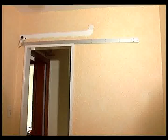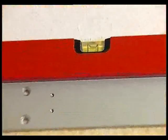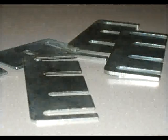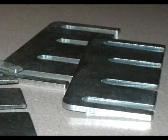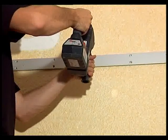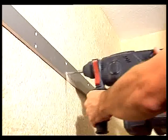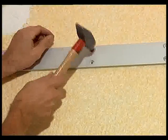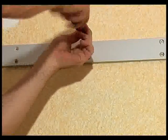At this point, it is essential that you abide exactly by the stipulated dimensions, so double-check and readjust if required. Use the enclosed distance plate to compensate uneven walls and discrepancies regarding the clearance with respect to the door frame. The shim plate is also used as drilling template and need not be removed as long as you stick to all dimensions. The next step is to drill all further fixing holes through the holes in the shim plate and to insert the respective dowels. Proceed with the mounting bracket as described above when no shim plate is required.